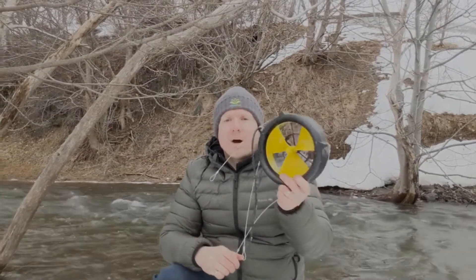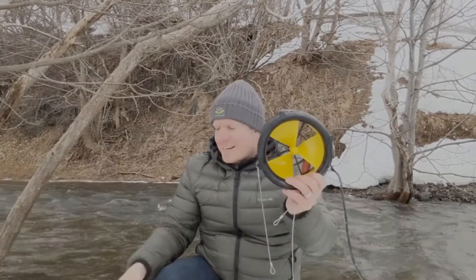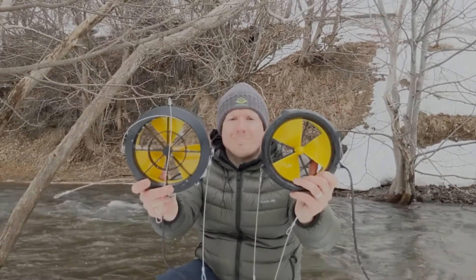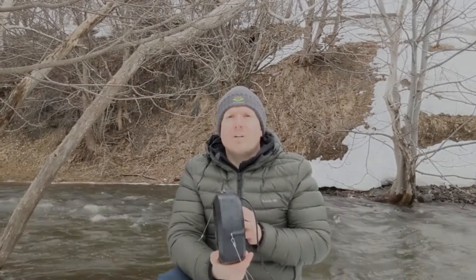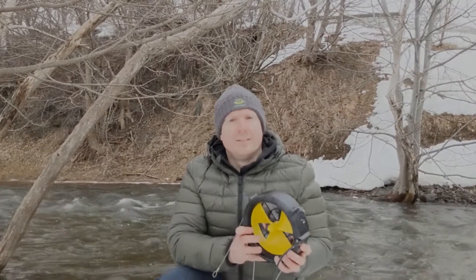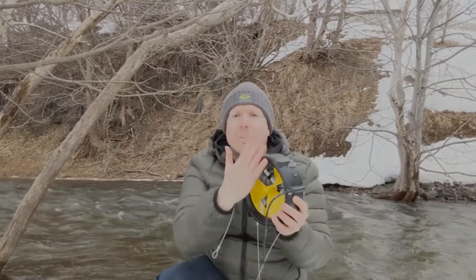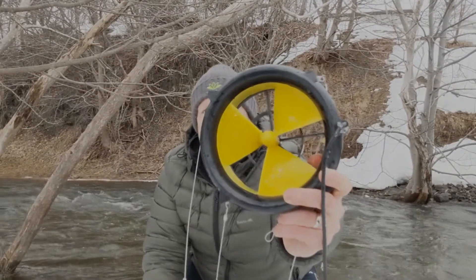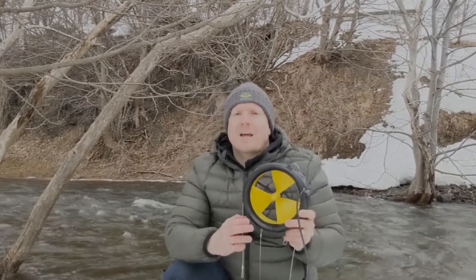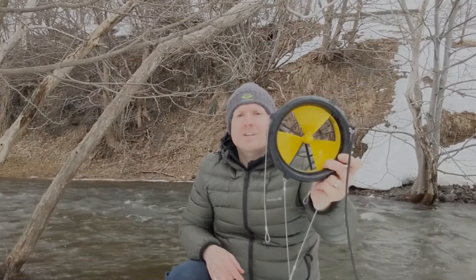When you attempt to set up Water Lily, the first thing that you may be wondering is, well, what side is the front? What I mean by that is, where does the water flow into the turbine? So this here is the front. Water must flow into the open side of the turbine, and if you look closely at the blades, you'll notice they're shaped concave on this side. Think of it like this — the blades are catching the water.